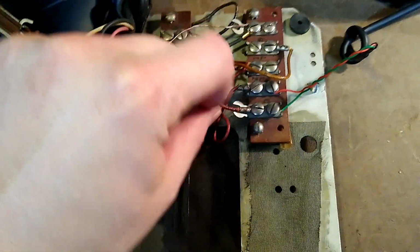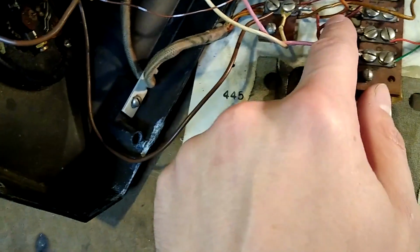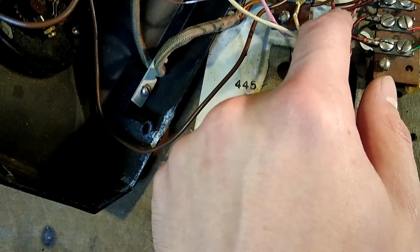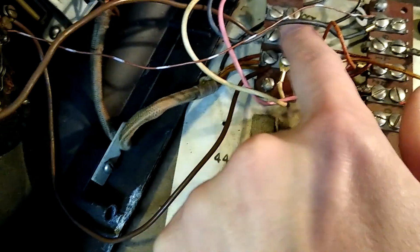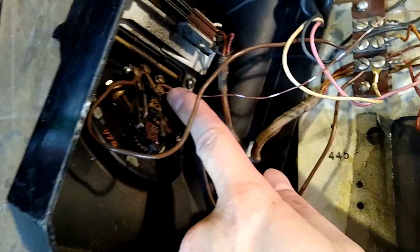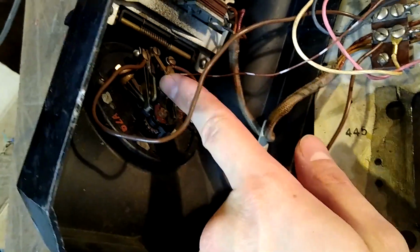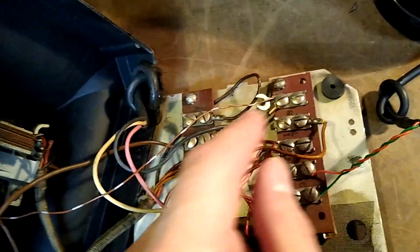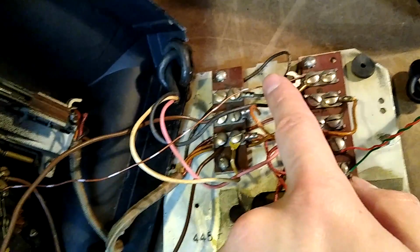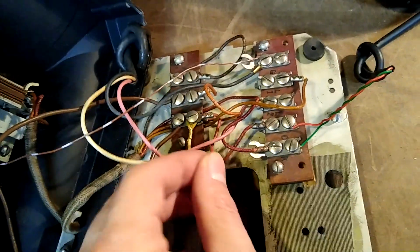That switch is this wire, the green one in this particular case, how I wired it, and the other used lead from that hook switch comes over to this terminal and goes over to the pulse contacts on the rotary dial. The center terminal that bridges the normally open pair of contacts to the normally closed pulse switch contacts goes to this black lead, one of the three leads on the headset, and the white lead of the headset returns to the red wire.